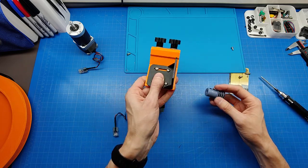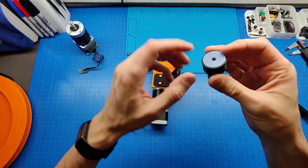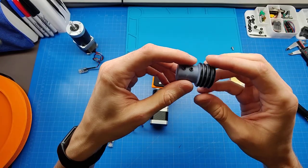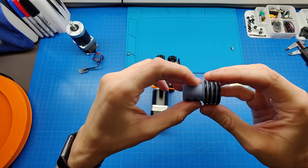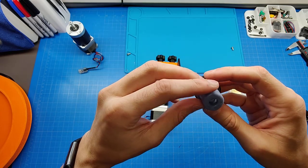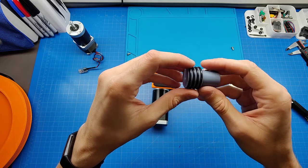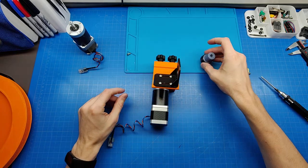Yeah, another option to adjust elevation is to basically just move this pulley. As you probably see, this pulley is not orange. It's printed on MSLA just because it's a precise part which will affect my timing and things, right? I printed it on MSLA because it makes it very smooth and much more precise than an FDM printer. On an FDM printer, I would probably have had to switch back to a 0.4 millimeter nozzle to print it with higher accuracy. But if you print this piece on FDM, I don't think you will feel any difference in mount performance. So yeah, just for peace of mind, MSLA is more round.